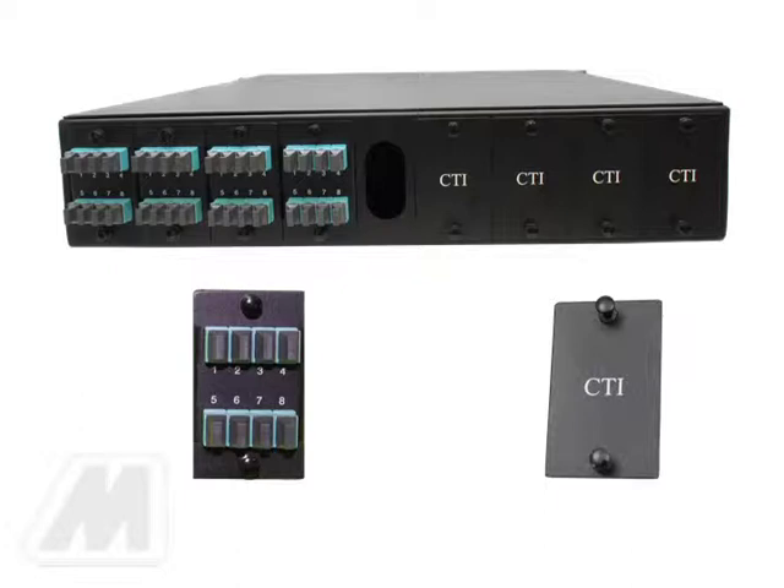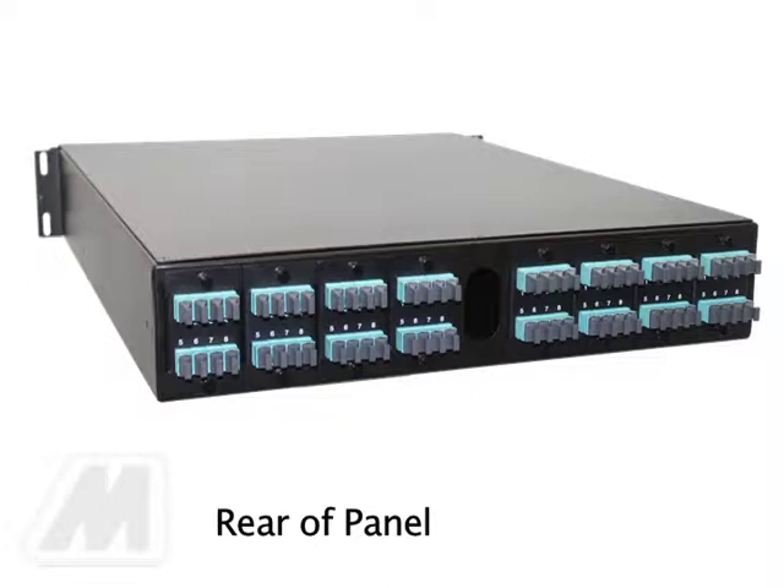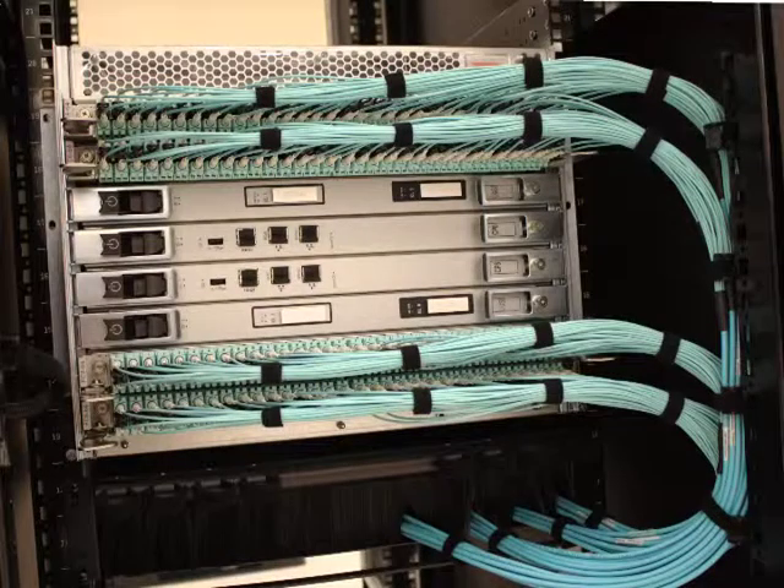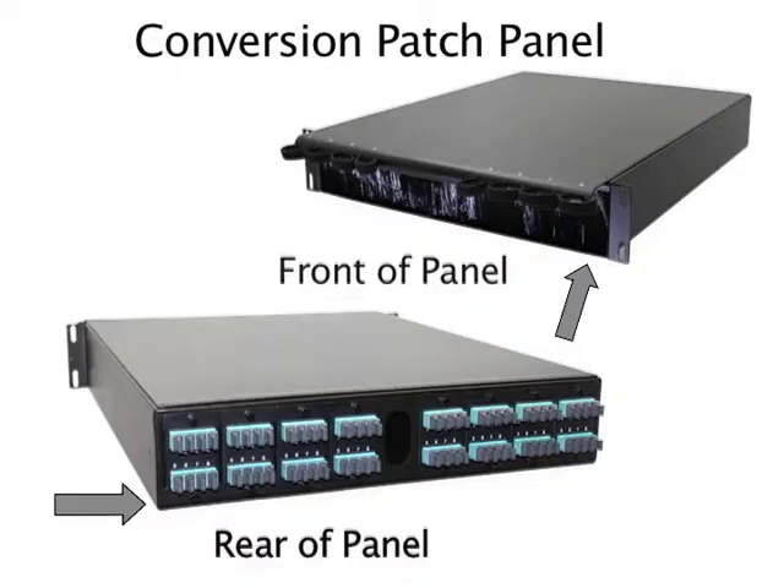If you did not install the coupler plates and/or blanks in step two, do so now. Note: when facing the rear of the QCS patch panel, the cabling channel on the far right side of the patch panel and the associated MTP coupler plate coincide with the number one blade position on a DCX chassis with vertical blades, which is the blade on the left side of the chassis when facing the front of the DCX chassis, and port 00 is the port on the lower left corner. When utilizing the QCS patch panel with the DCX4S chassis, the blades are horizontally mounted, the number one blade is the bottom blade, and port 00 is the port on the lower right corner. When facing the rear of the QCS patch panel, the cabling channel on the far left side of the patch panel and the associated coupler plate coincide with the number one blade.